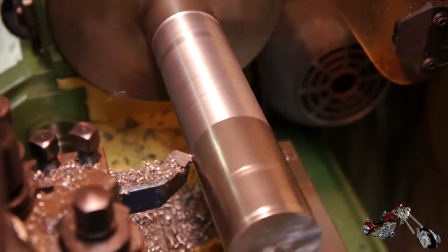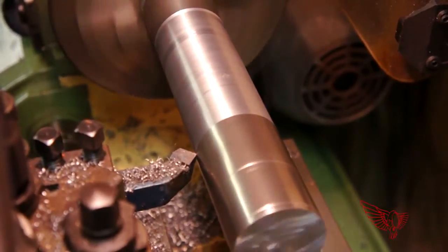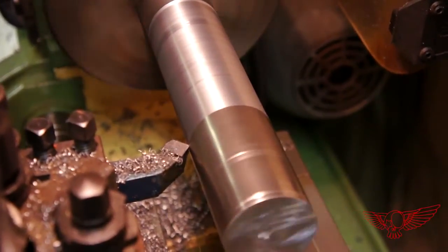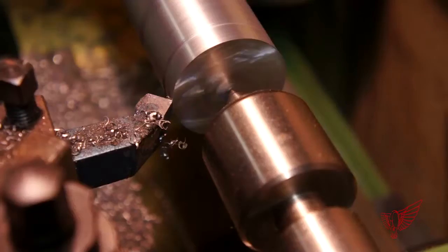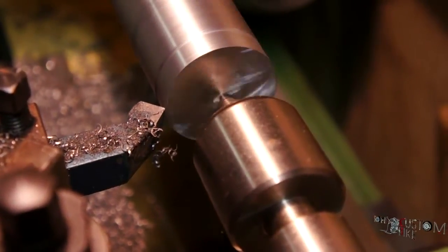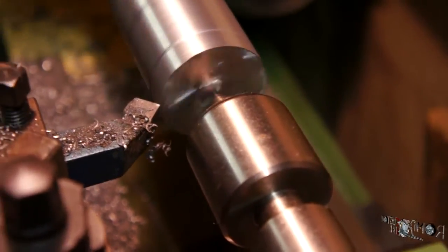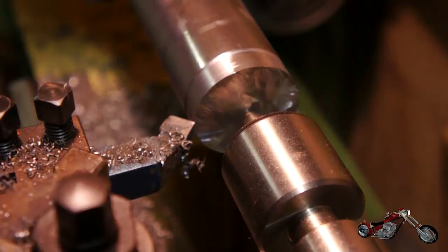This is because most of the stock we buy is not perfectly straight. This is evident also by the fact that removed material is coming out in short chips. The process continues all the way to the end of the piece of stock. Pietro has positioned the tail stock in an effort to keep the piece as aligned as possible. You can see that a portion of the circumference of the stock hasn't even been touched by the tool — that's not a problem, although you need to be aware of it. As machining continues the problem will be fixed and the piece will be straight in the end.